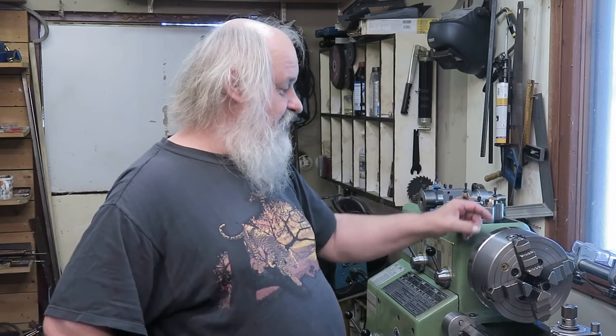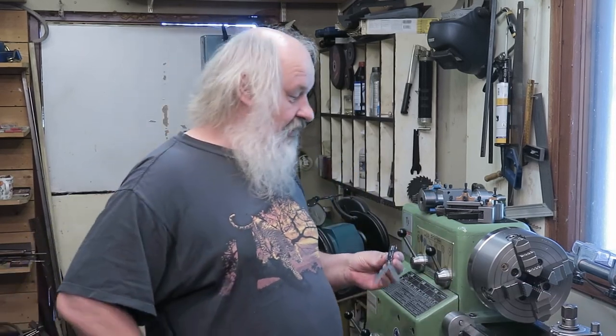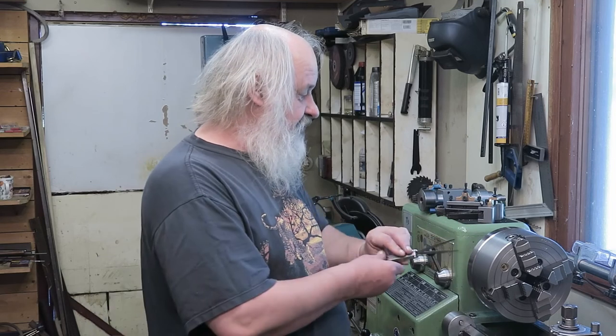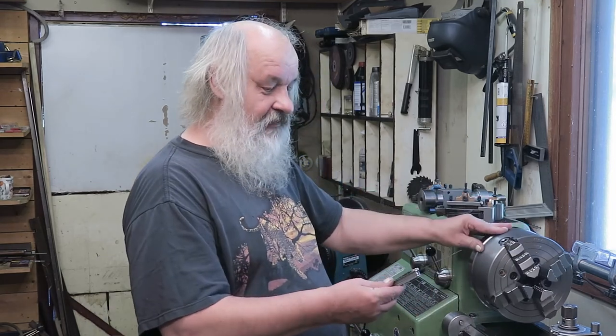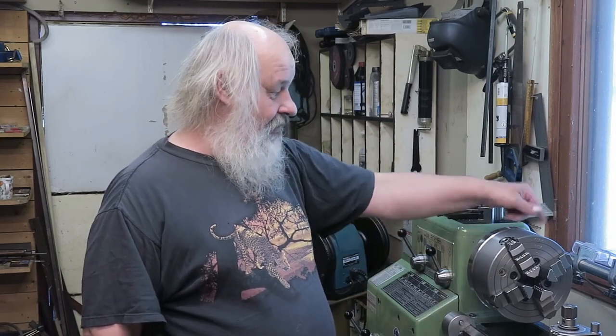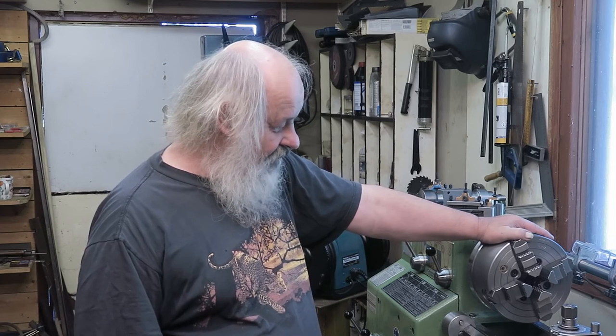The second mistake was to assume that you have to support it from the rim. No, you should not, actually. If you do that and you tighten it on the center, it bends the chuck somehow, and then these jaws will bind. So now I have here everywhere, this is a 0.2 millimeter feeler gauge. You can put this 0.2 everywhere, 0.25 you cannot put nowhere. So I arranged a 0.2 millimeter gap between the backplate and the rim. Yeah, that was one. And other than that, it's okay.